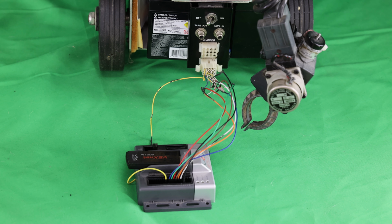Alright, I just plugged in my VEX Cortex Teaching Pendant Emulator, and I plugged it into the Teaching Pendant port on the Hero 1 robot, as you can see. The next step will be to power the VEX Cortex, and for that I just need a standard battery, or I use an external power supply. The VEX Cortex usually uses a 7.4 volt NiCad, or the RC type batteries. And Innovations First Incorporated sells them specially made for the VEX Cortex and VEX EDR systems.